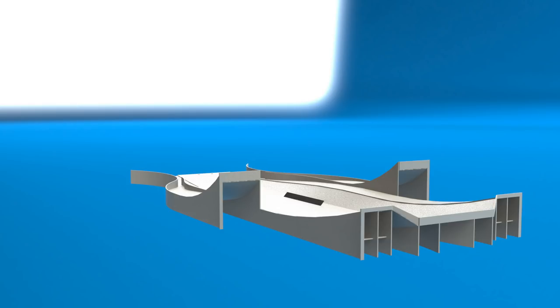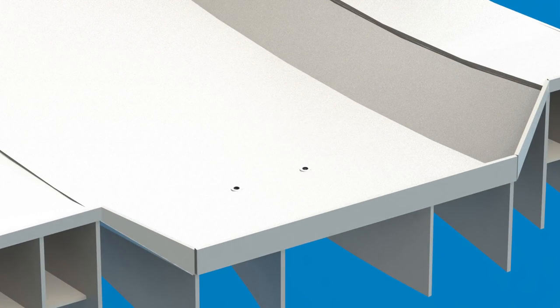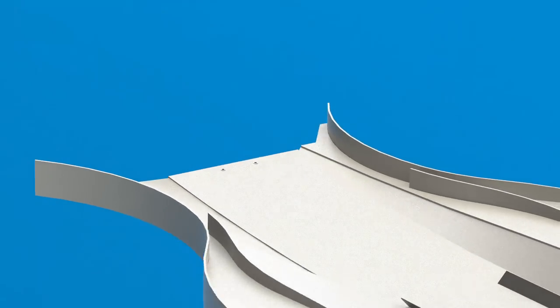Once the fiberglass went over the lot it would become a very rigid mount from the undertray to the chassis. The tray would also bolt to the rear subframe using the exhaust mount as well as the front of the chassis to the floor. These points would need crush tubes and load spreaders made out of aluminium bonded to the foam to prevent the foam from being crushed. The composite panel is very rigid but cannot take point loads, so wherever one would occur I'd need to find a way to spread the load.